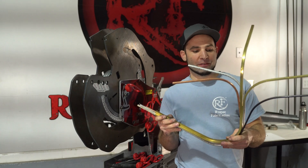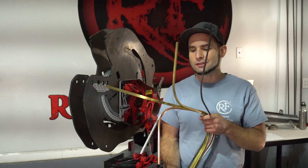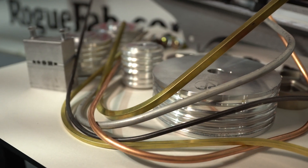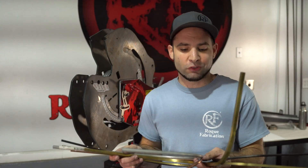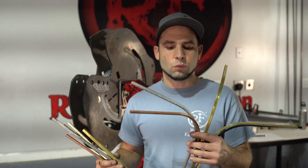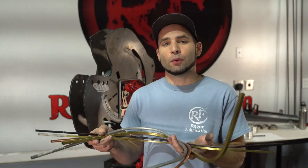This is actually the first time I've ever bent on one of our 5X combo dies, but this is a really cool way to get all five of these sizes into your shop for bending tooling that's made in the USA with a lifetime warranty, affordably. These 5X combo dies are a great way to affordably add several sizes to your shop all at once, and they do a good job on thin wall thicknesses like 032. This is a 3.5-inch radius version. We also have the same die available in a 2.5-inch CLR — centerline radius.